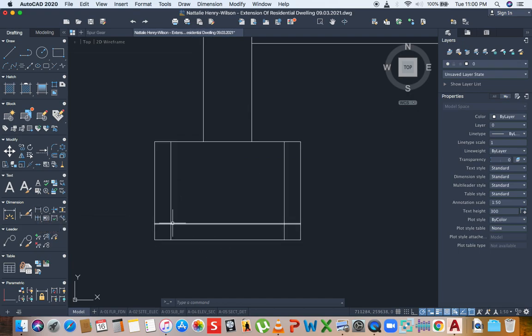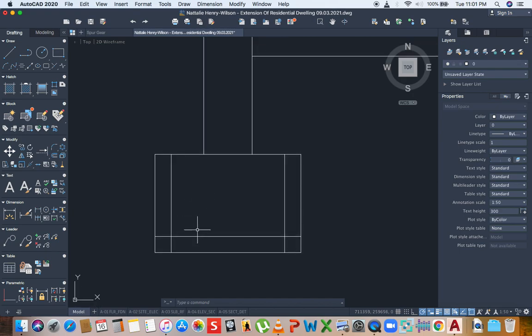So that, because the steel bars, when they are placed in the foundation, they should not be placed directly on the ground, because when you pour the concrete to cast the foundation, those steel bars will be exposed to the earth, which consists of salts and other minerals and moisture, of course, that will very quickly cause the steel bars to rust. And when they are on the ground, they will not be acting as a part of the concrete footing to bear the load properly. So you have to have what we refer to as a cover.